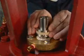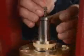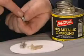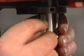Slide the assembly carefully down the shaft onto the stationary seat. Do not tighten the set screws yet and do not remove the packing tape. Replace the collar, lock washer, and cap screw, then insert the hex driver carefully into the pump shaft positioning hole and tighten the cap screw. Apply a thin layer of non-metallic compound to one side of the motor shaft key and to the pump shaft key, and place these in position on the motor shaft and pump shaft. The compound will help keep the key in place while you install the split coupling.